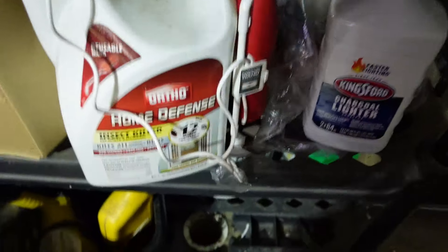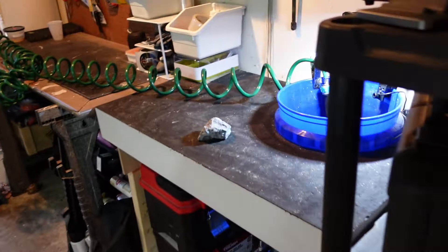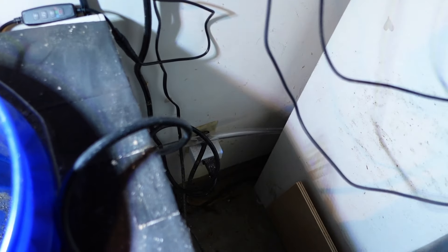Now it's time to see — is it actually draining? So here's the overfill pipe and here's the hose, and nothing is coming out. Something's wrong, so we need to figure this out. As I look at the back right here, I see that the hose is actually pinched. If you look down there, you can see the hose is pinched right there. Right before that pinch is where all the water's just kind of waiting. So I know I need to pull that thing out, get the hose unpinched, and probably bring it all the way down to the ground just so gravity can do its thing. Now it doesn't have to be flush with the ground — it can go up a little bit because as something siphons, the momentum of the siphon will help pull it up small uphills, as long as there's not anything too significant.